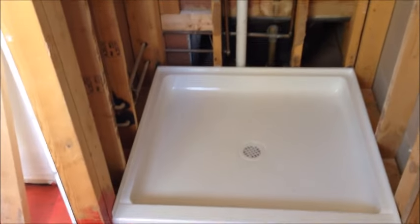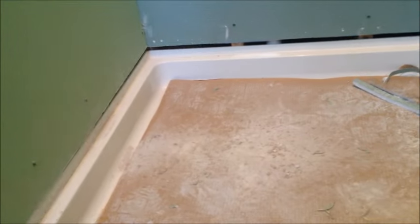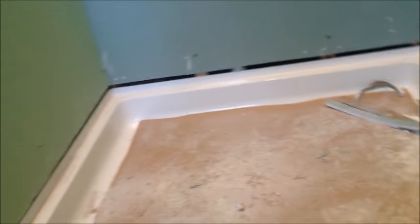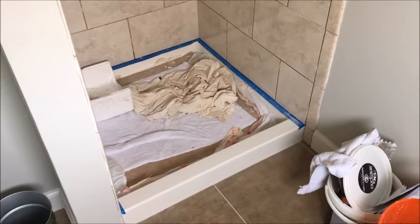When I put up the green board it will be perfectly flat, so when I put tiles over it there are no bends in the wall. Next step is putting up the green board and we'll see how that looks with the shower base. We got the green board in — I have a little nook there that's been framed out. All along the bottom we have at least a half inch gap all the way around. The cardboard in there was just to protect things, but everything is installed as far as the shower pan goes.